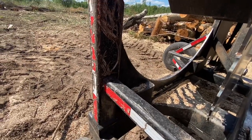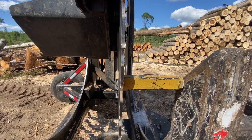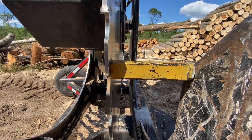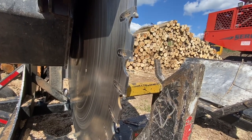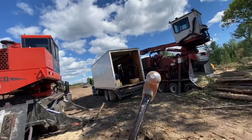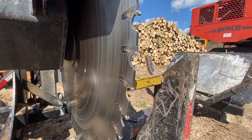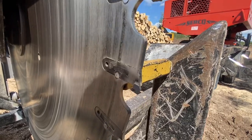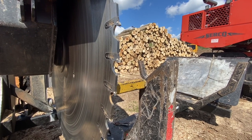It's a coarse thread in the clamp, fine-threaded nut coming out for your knives - that's kind of how that works. She's junk either way. When you heat stuff to get it out, you hear bad stories of what happens in there because stuff starts coming out and flying at crazy speeds. I've heard stories of clamps coming out of there and going through semi trucks - not cool. Therefore when you heat it, she's junk. So we just cut her off. The gentleman asked about just heating it - yeah I could have, but it's too fine with stuff going on there, things going too fast.